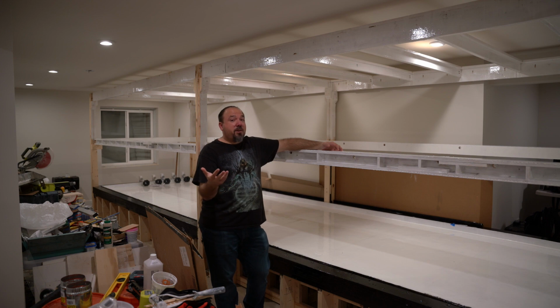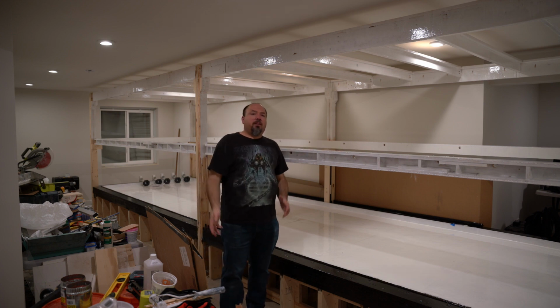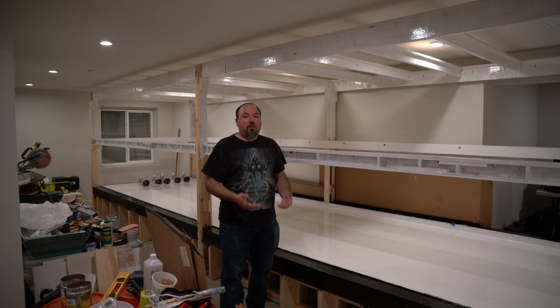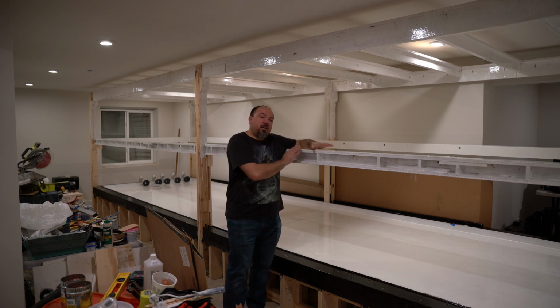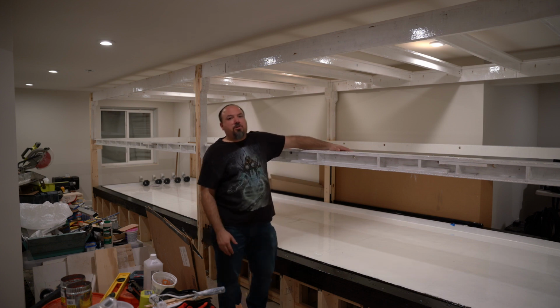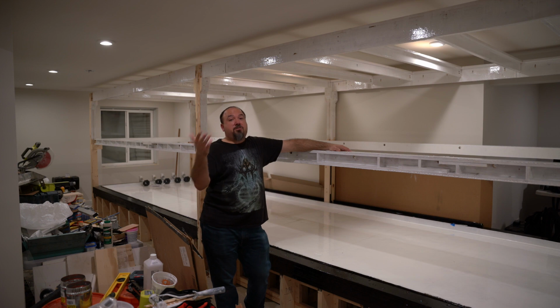And adding this fiberglass in here is 2 things. One, it adds a very thick layer of waterproofing, which really just helps with an aquarium this size. And 2, it adds an enormous amount of strength. It provides things like impact resistance to the bottom of the tank in case a rock or something were to fall. And also for areas of the aquarium like the top aquarium brace beam structure, where you have these 4-inch by 4-inch beams, it adds an enormous amount of rigidity and strength as well to these beams. So they just are a lot stronger overall to keep this structure intact and just increase the strength overall.